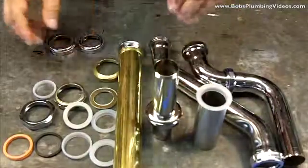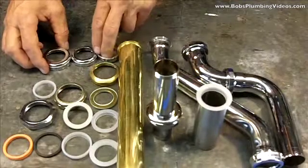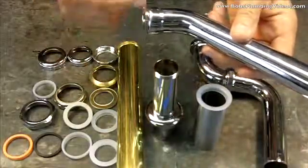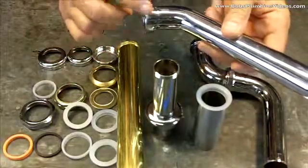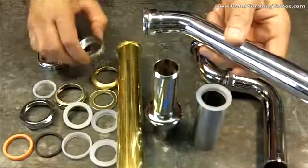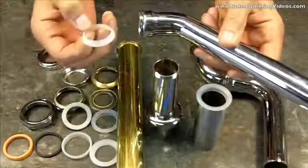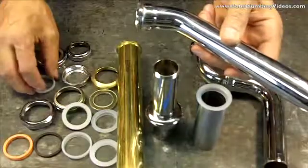But in any case, when you make the connections using these nuts, what I suggest is to always lubricate the threads on your fittings. Plumber's waterproof grease works, and I carry that in my faucet repair kit, but a lot of times I'll just have a little pipe joint compound. Very sparingly put that on there, and it allows the nut to run up freely, and if you're using the beveled washers and you lubricate this, you can literally hand tighten everything.